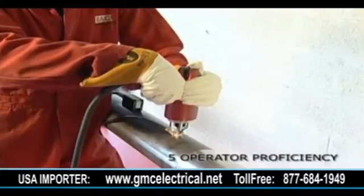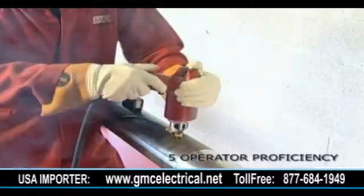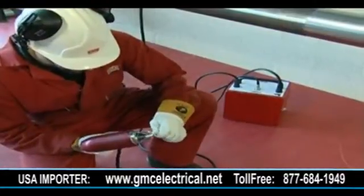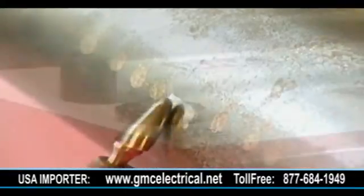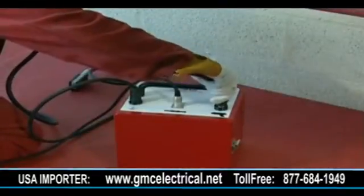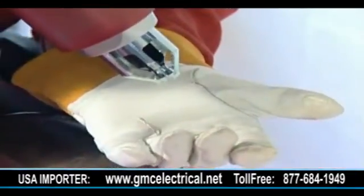Five: the operator must be trained and hold the brazing gun very still for the duration of the braze, which should be approximately two seconds. To load the gun and prepare to braze: grind as required, attach the earth device securely to the battery box, attach the brazing gun securely to the battery box, and check the previous fuse has been ejected.